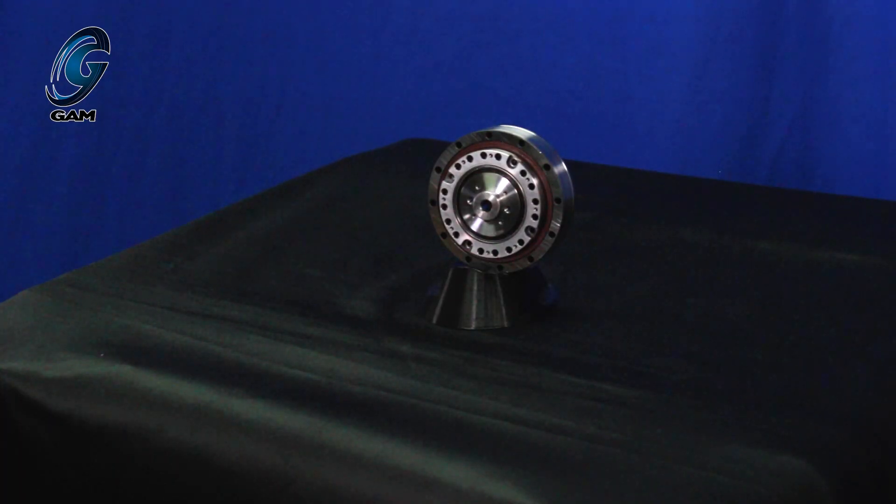Hello, my name is Craig Vandenavant and today I would like to introduce you to strain wave gearing components and how a strain wave gearbox operates. Strain wave gearboxes provide zero backlash and high torque with high ratios in a small, lightweight gearbox for easy integration into a mechanism or machine.